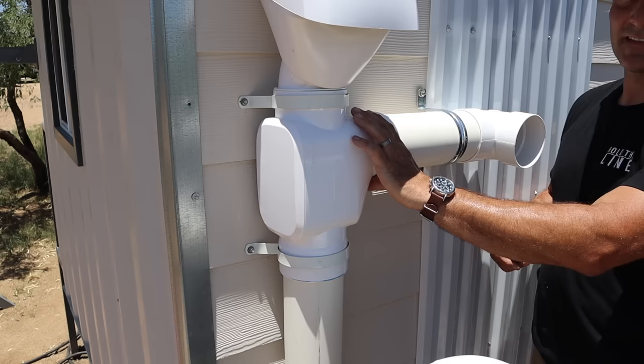It's a little tighter fit than I anticipated, but I don't think it's flexing it too badly. The actual last step of this installation is adding the water level gauge onto the tank. I'll drill an inch-and-a-quarter hole on top of the tank, drop the float in, and when it sits on the bottom it indicates the tank is empty. I hold it up flush with the bottom and set the top indicator to show when it's full, done by just popping the cap and adjusting with your fingers.